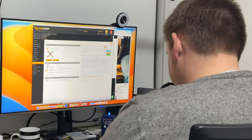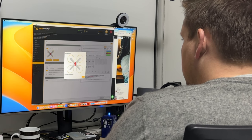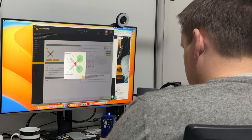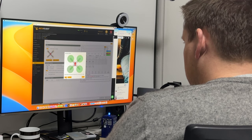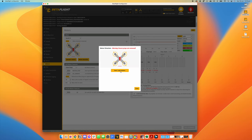Step two: without your props on, reorder motors. I always do this whether I've changed the ESC layout or not — just make sure it's always correct. If you're running props out, tick 'motor direction is reversed.' Then click motor direction and follow the motor direction wizard to ensure that the motors are spinning in the same direction as the arrows.